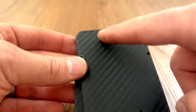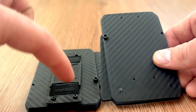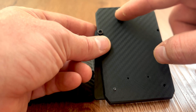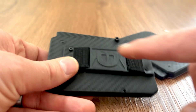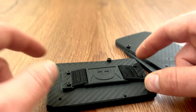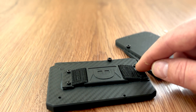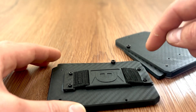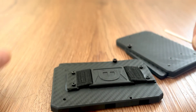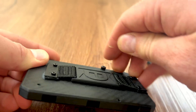Last little bit — you'll see four screw holes on the back. That is for the elastic strap that you can add on; it's optional. You probably saw these parts. These are M2 screws — I think I used four millimeter ones. What I did was I cut off a piece of about three inch elastic. I took both pieces — there are four pieces total, the bottom half and the top half, two sets of two pairs. I glued it onto here and made sure I lined up these holes on both sides, then ran my screw through. It actually punctured through the elastic no problem because it's kind of stretchy and fibrous, and I just sunk it right in. Maybe I'll make a video later on how to do that. This is good for holding money or whatever else you want.